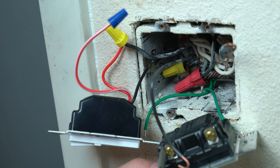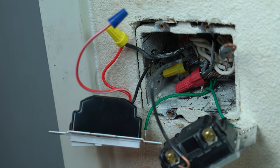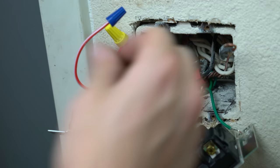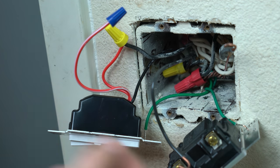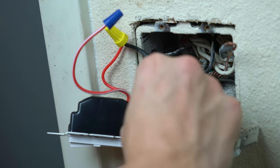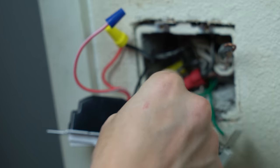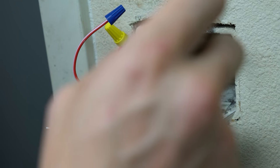So we would use things like aluminum that we would dip in copper or coat with copper, and that's called copper clad aluminum. So the entire conductor was aluminum, but it had a little bit more conductivity on the top of it because the material at the surface was copper. That's pretty interesting, right? So we went from aluminum conductors to copper clad aluminum conductors to full copper conductors.